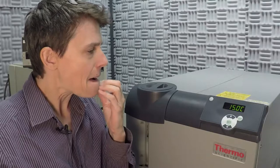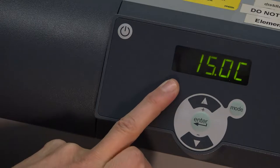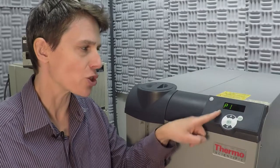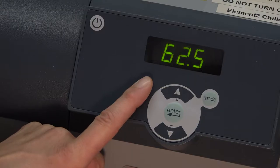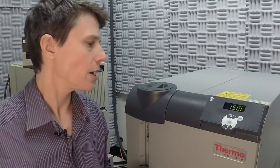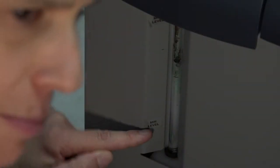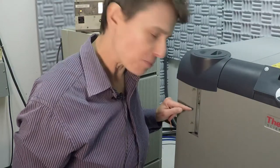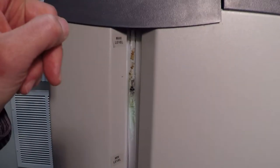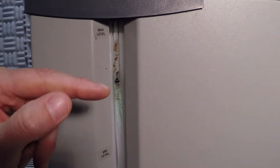Here is the E2 chiller. We never turn this off. The temperature of the water is 15 degrees centigrade and should always be 15 degrees centigrade. When you press the button down, you can check pressure. The instrument is off right now; the pressure is 62 PSI. When the instrument is on, it's around 54 PSI. Hitting the button again comes back to the temperature. When checking the water level, you want the water floating ball to be between minimum and maximum levels. We've drawn a little black mark where our water level usually sits. The ball is a little low — I'll add some distilled water to make sure that ball goes up to the proper level.